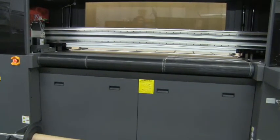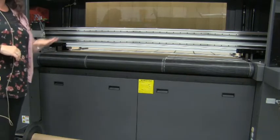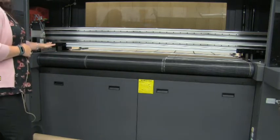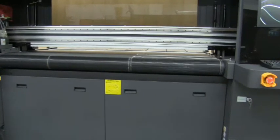True hybrid functionality makes the vacuum table hold the material down with a belt to drive the material through the print surface. The vacuum table is designated into four individually controlled chambers, easily controlled by four ball valve handles on the right-hand side of the press.